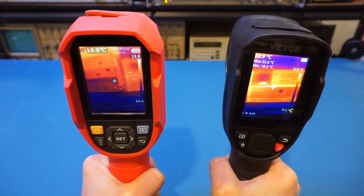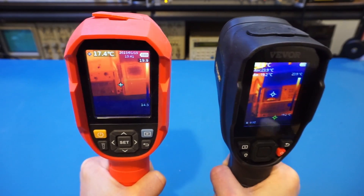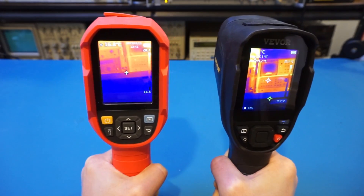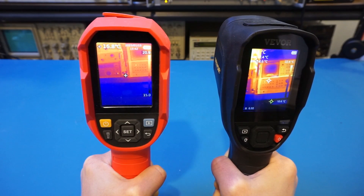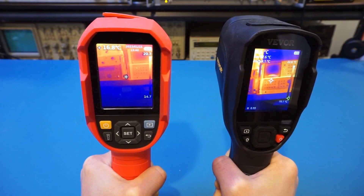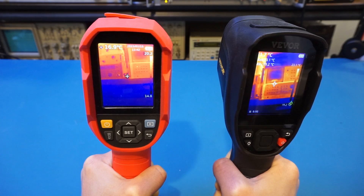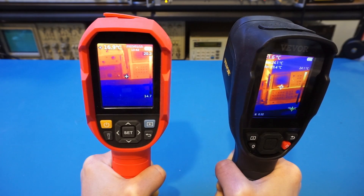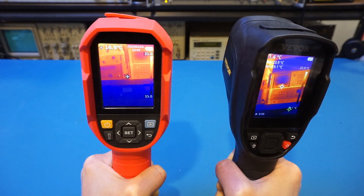Once powered on, the image quality is actually excellent. Just by looking at the background, I can already say that the image captured by this SC240N is less noisy than what is captured on the Uni-T UTI 690B. This is not surprising, given that the thermal sensitivity for the SC240N is specified at less than 40 mK, whereas the UTI 690B is specified at less than 60 mK. Thermal sensitivity is sometimes also specified as noise equivalent temperature difference, or NETD — the lower the NETD, the less noisy the image and the better the thermal image quality.